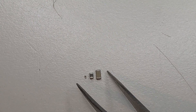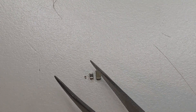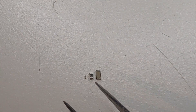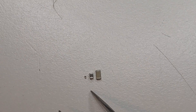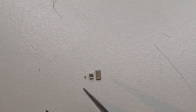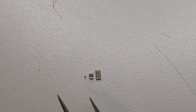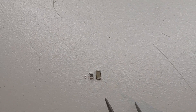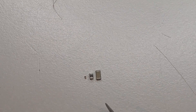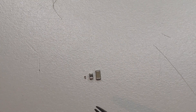The very big drawback of ceramic capacitors is that they tend to crack. And if they crack, it's a bad thing because they can conduct current and mess up a lot of things on our devices — especially on 4-in-1 ESCs, because we have a lot of them. When you do crashes with a lot of current and switching, if one cap just cracks, you can say bye-bye to your board.